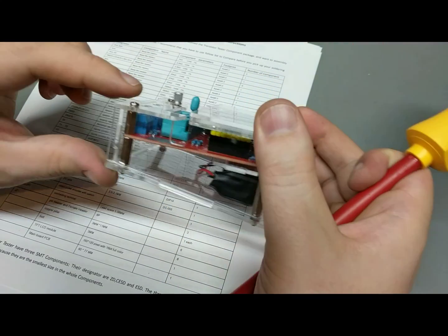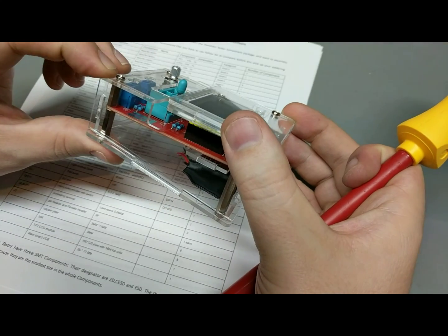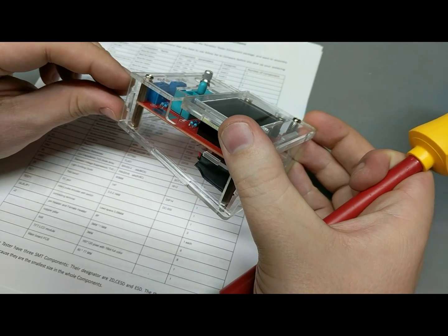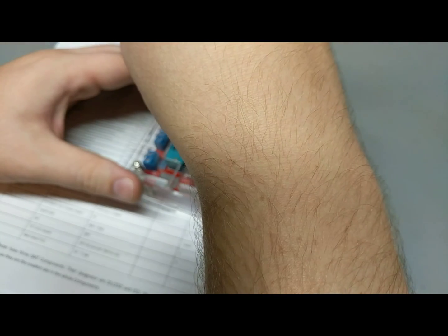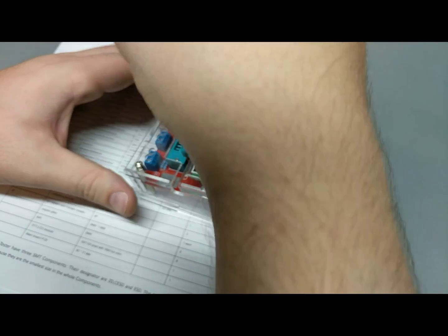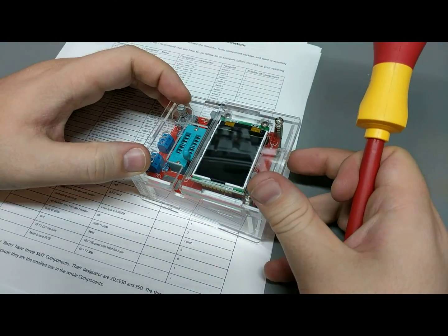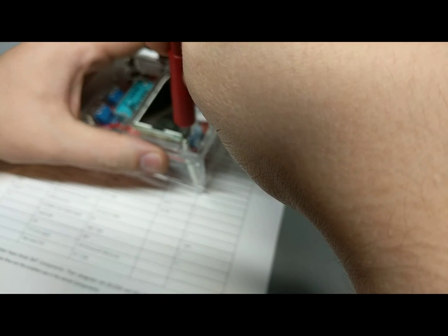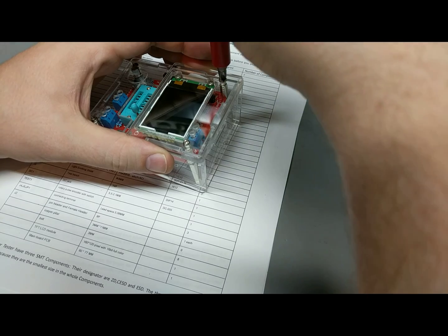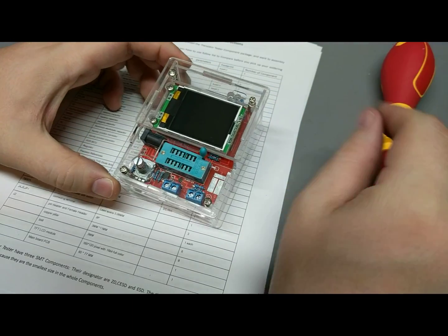Okay, so I don't want to screw these ones in the back too far because these standoffs aren't long enough. They're just like not even an eighth of an inch too short, so if you tighten them down too much, it's going to crack the Lexan. So we're just going to leave it slightly like that. These ones, though, these should be able to tighten down pretty good, or reasonable. It's just plastic. Okay. Hey, at least it looks reasonable.